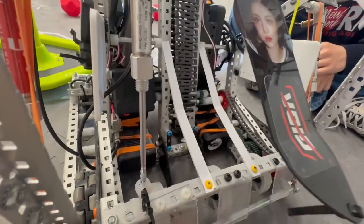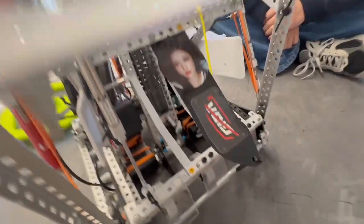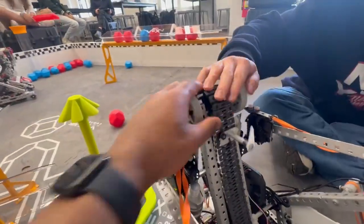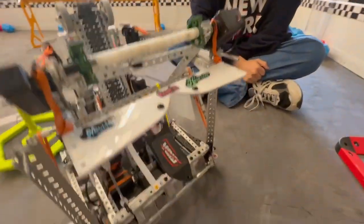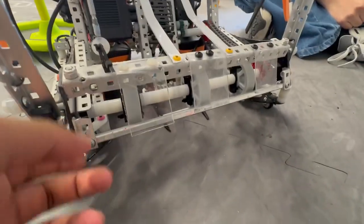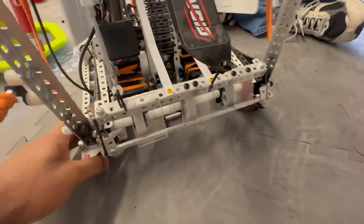The bar that our intake is mounted on is literally the lowest possible it can be. The reason we did this is so the ring is mostly on the second stage of our intake, because we have full control of it — we know the position in the code. We have the position of the hooks at all times because we start right in front of the hooks before each match. So this gives us more control of the rings at all times and allows us to rely less on the ramp. Even if we didn't have a first stage intake and this is up, the ring can literally glide in.